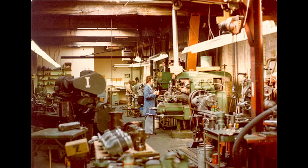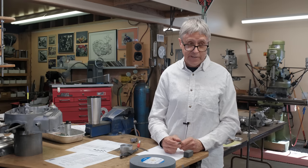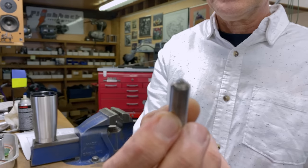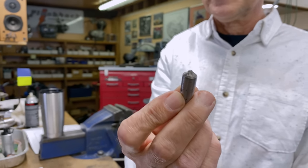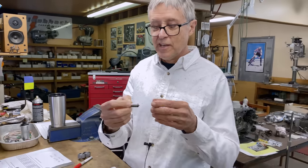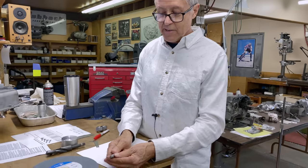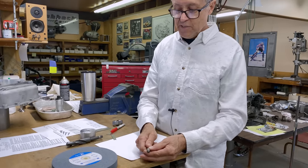I ended up working on an internal grinding machine for about half a year. All the stones there are sharpened with a diamond on a stick, or a single point. I've had this one maybe 40 years — it never wears out. It's an industrial diamond, not an ornamental diamond. On those machines this is mounted and the wheel moves back and forth, so it's really precise. On something like a hand grinder I just hold it by hand, and I'm going to show you — we're going to put this onto the grinder and watch me sharpen the wheel.